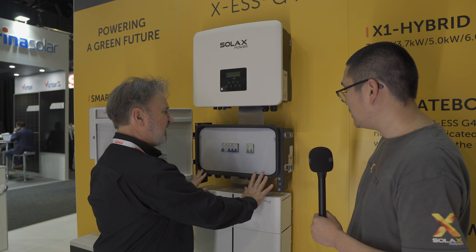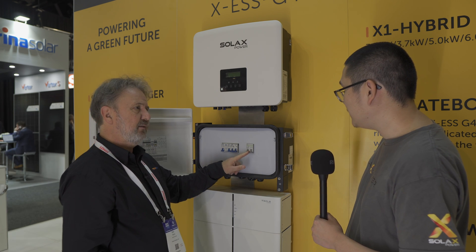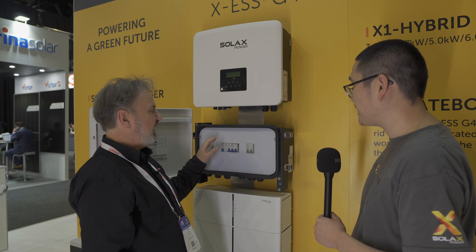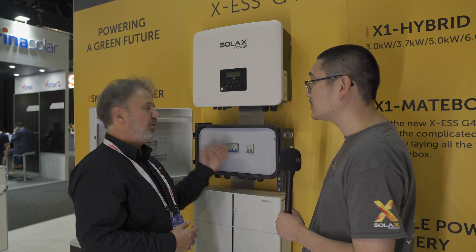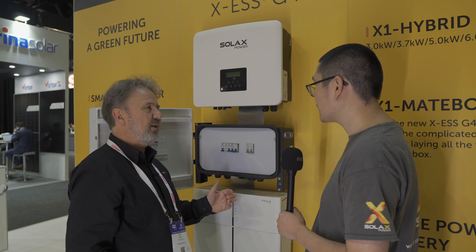By the look of it, this is IP65 too. Yes. So we've got a DC isolator — this is for the PV or the battery. This is just a demo, so it can actually have a cutout to suit the requirements. You can adjust this to suit whichever market you need to source. Metering requirements, contactors for controlling loads maybe. So this is basically a little switchboard that is prebuilt.